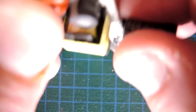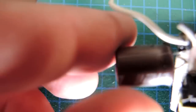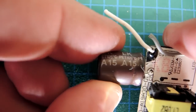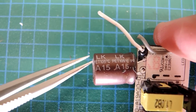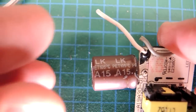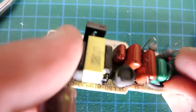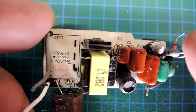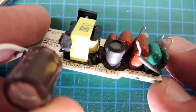The capacitor is probably one of the bits that will tend to fail over time. It has a temperature rating — let's see if I can get the camera to focus on it — 105 degrees centigrade. Not the best, not the worst. There's a grade below at 85 degrees and several grades above, but not the worst. Maybe that's the theme of the bulb — I've certainly seen much poorer constructions for actually a little more money, so not too bad.